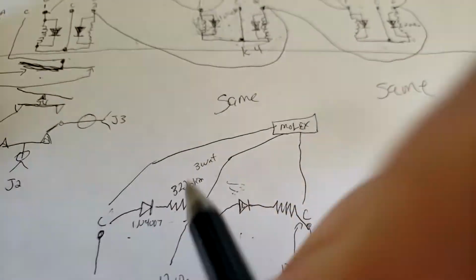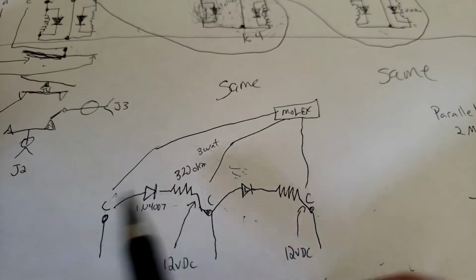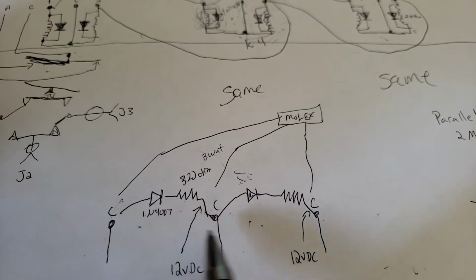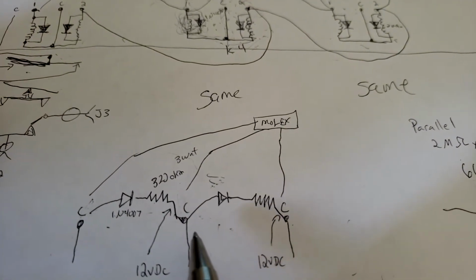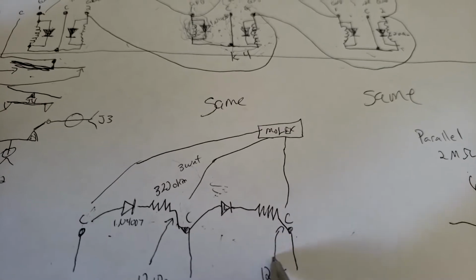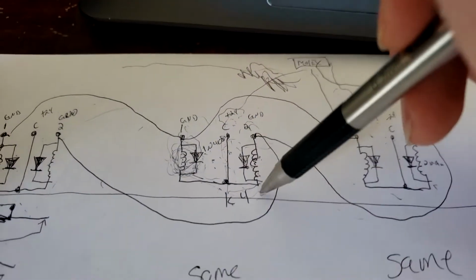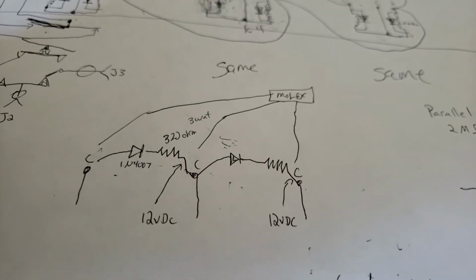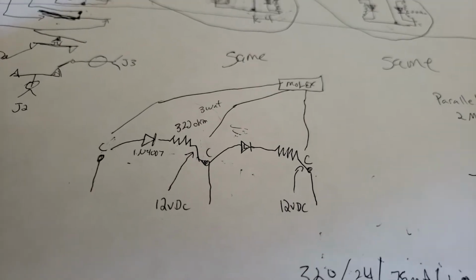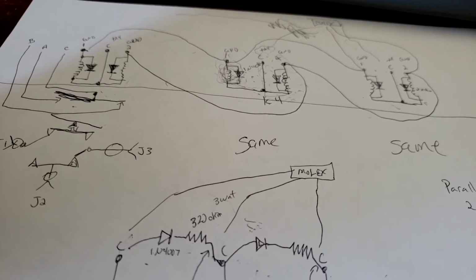But this configuration, as you'll see tested in a minute, will allow you to still independently operate each coaxial switch, each relay circuitry within the switch, but still overcome that issue where you will have a stuck relay. So this is just an opening to this. In the next video, you'll see me test this out, and then we'll get into the remove and replace of the entire K4 coaxial switch assembly.